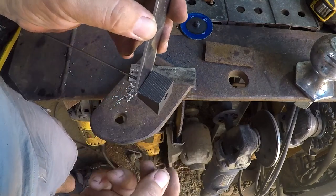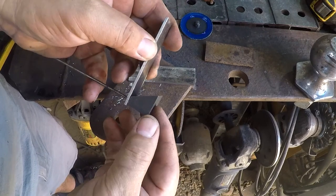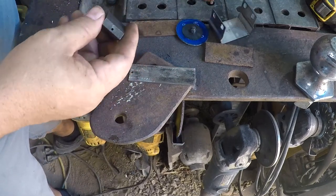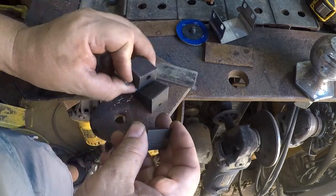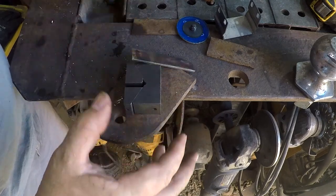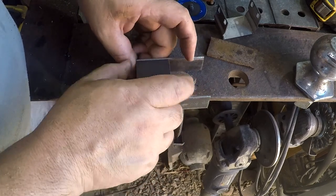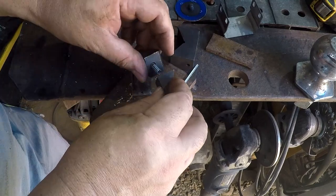This is what we're aiming for, and that way the die can slide on the tungsten pin, I guess actually it would be in this orientation. Hopefully it keeps it mostly straight so everything engages evenly. So I need to put all of this back together again. The challenge is trying to figure out how tall to make this thing. I may need to braze those pins in first. Yeah, let's braze those pins in first. That way I can clamp this together.